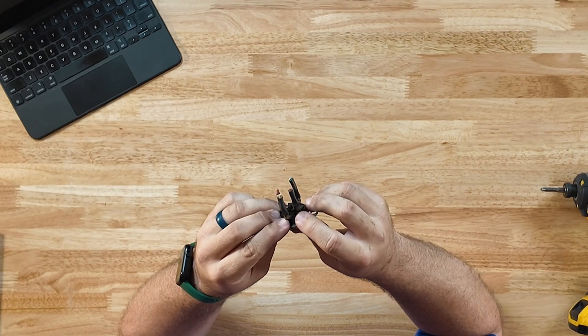This is a high limit switch — a very important safety component found on almost every electric furnace and in different styles on gas furnaces too. It makes sure the unit doesn't get too hot, because excessive heat can damage electrical wires and other components. It's a simple disc device — when it gets hot enough it pushes in on the disc and opens the circuit so power can't flow through. Once it cools off, it pops back and resumes operation. When these go out, it's typically due to constant cycling on and off.